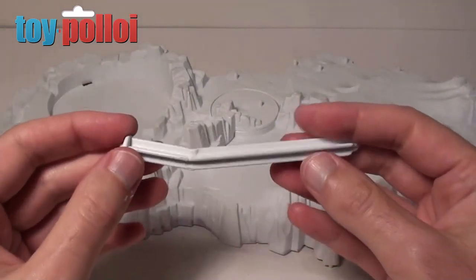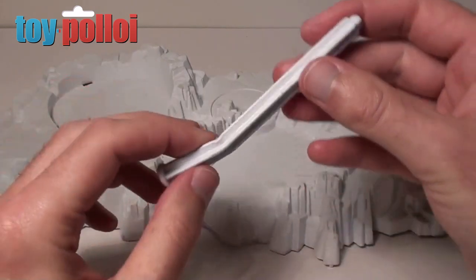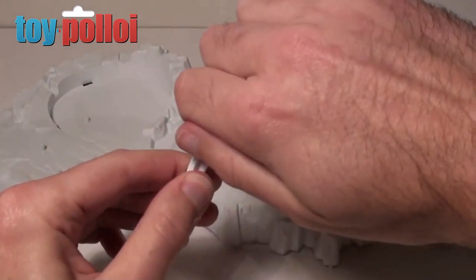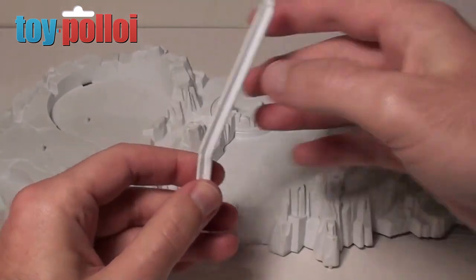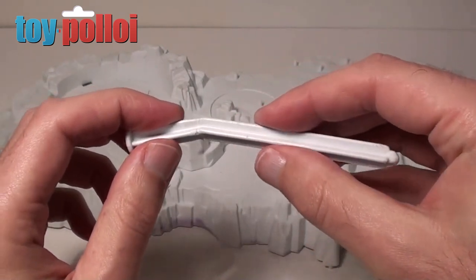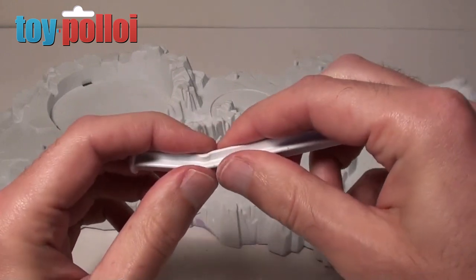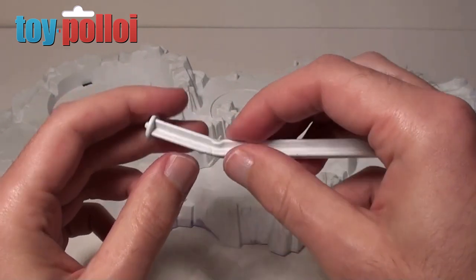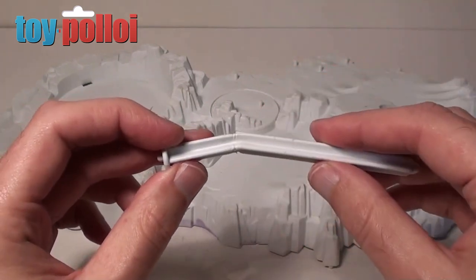So the next thing we need to sort out is the post that holds up the Probot. This has been bent at some time. As it sticks out of the top there, that's obviously a weak point where you can just clearly bend it and it will get held by the base and almost snap. So what we're going to do here is try and bend this back to being as straight as we possibly can. Now you don't want to just go ahead and bend this — what you've got to do is warm it up first. So I'm going to get the kettle and a cup and use some hot, almost boiling water and we will see if we can straighten this out without breaking it.